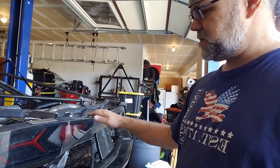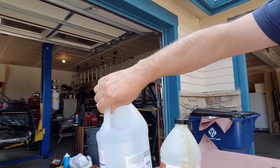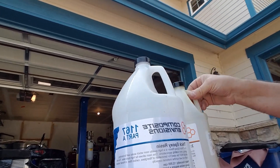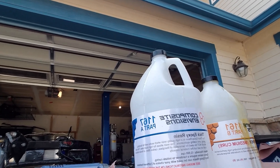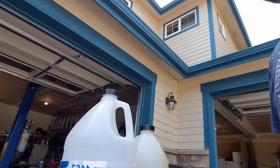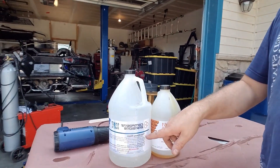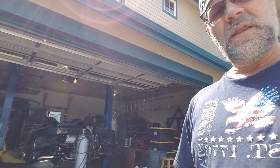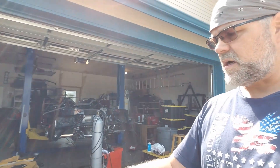So this is basically the state of things right now. Here's the epoxy we used — it's relatively inexpensive. I get all of my supplies from Composite Envisions. This is the epoxy resin and the hardener. This is actually a thick epoxy, and what I'm going to do for the next level is use some thin epoxy so that we don't build up too thick of an epoxy load, just enough to get it flatted off.